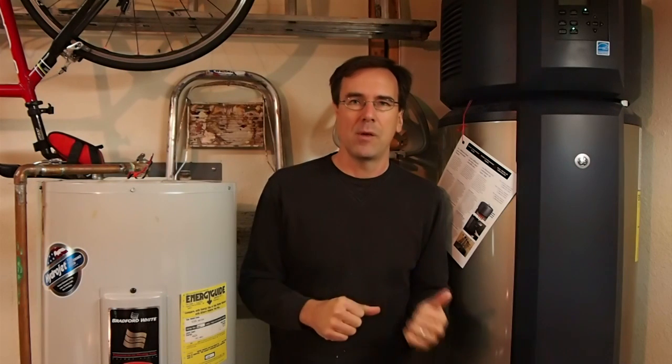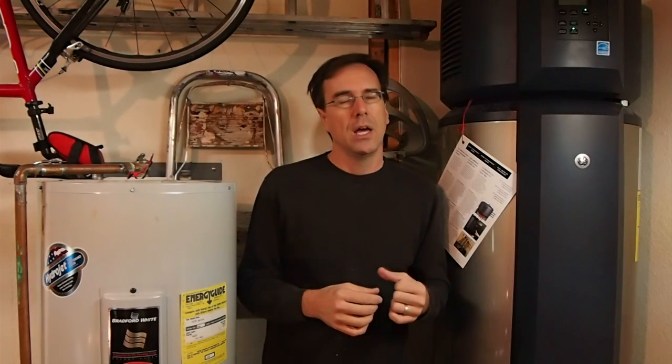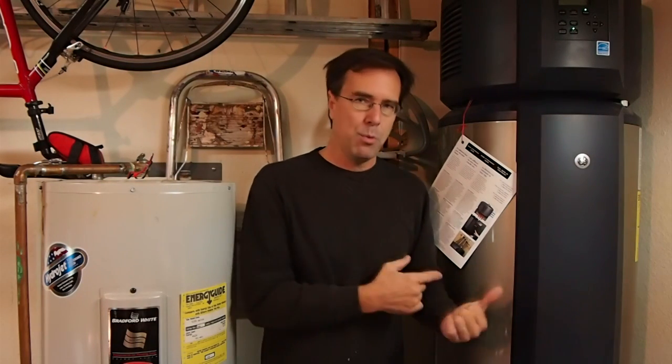Also, check with your local utility company. My local utility company offers $37.50 for an ENERGY STAR rated hot water heater — your utility company may offer more, so it's definitely worth checking. Now, if you currently have a gas hot water heater, forget it — gas is so inexpensive to heat with that this unit is probably going to end up costing you more money. If you're on propane, you'd have to run the numbers. But if you currently have an electric hot water heater, you probably ought to consider this one either as an immediate replacement or for your next hot water heater.